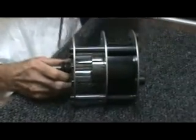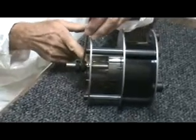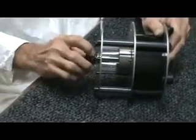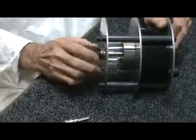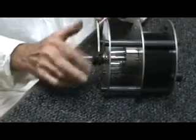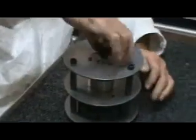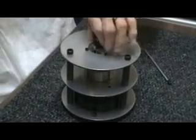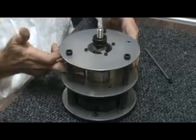Now that has socked in — this gap has disappeared. The gap up here has disappeared during tightening. Take this back down to zero and set it at about an eighth of a turn out — a very small gap. Set it down, turn, and listen. No touch. It's very nicely aligned.